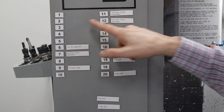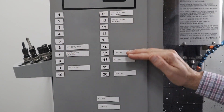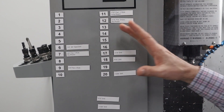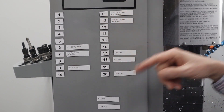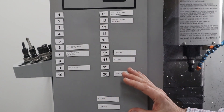I had this one here — I thought it was in slot three, but it was actually in slot 12. So now I have my slots labeled so I know exactly what is in each of these. And that means that when I come to the machine, I can look to see what I had in there last. It also means that when I load a tool in here, I want to make sure that I update this chart.